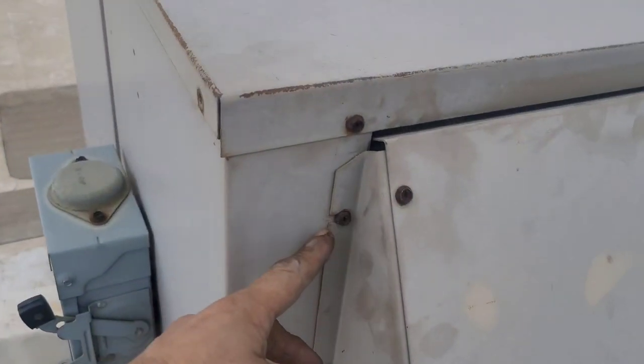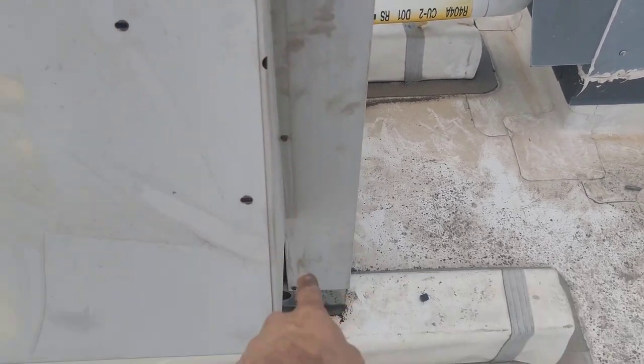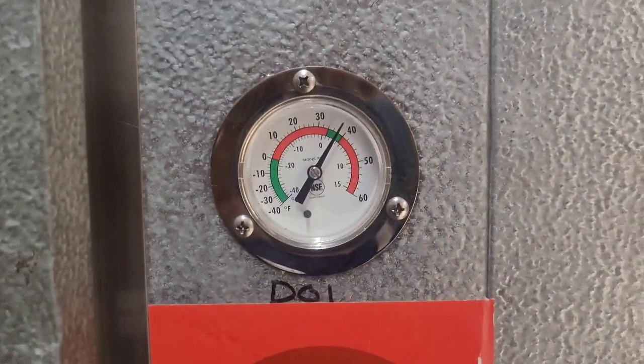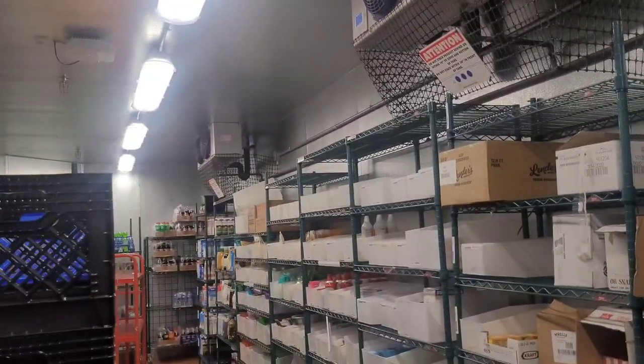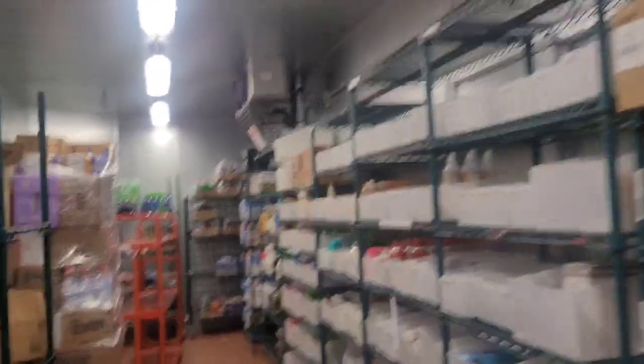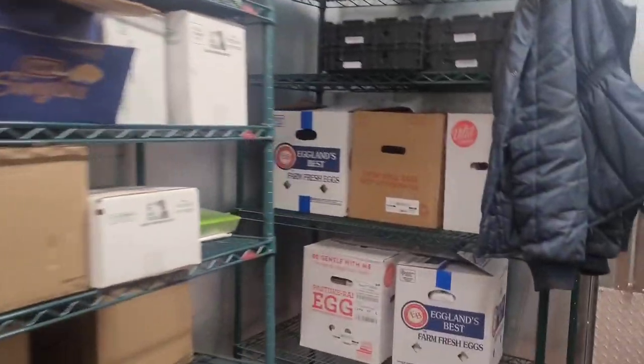That's going to do it for up here. Got the sight glass cleared, made sure it pumps down, got this hail guard back on. If you don't know how to put it on it can be tricky - get the top left corner in first, then lift up from over here, get the top corner, then get the bottom ones in. For our closing clip we are sitting at 38 degrees and this job is complete. This is the cooler connected to all this food in here - it all depended on our repair today. We made a good bypass for that leak, we did good work.